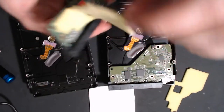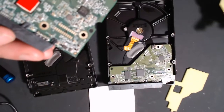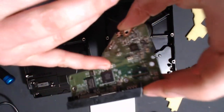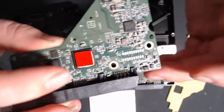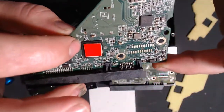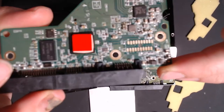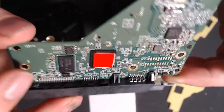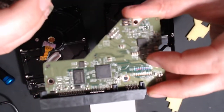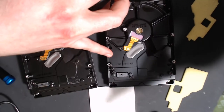This definitely has solder work on it — this is the one I fixed. I know it has solder work because it's sticky. This is a BGA chip — the connections are all underneath — and I definitely soldered that. But guess what — mine actually held up, because this drive got detected in my computer. I used CrystalDiskInfo and it said it was a good disk. This other one is getting freaking hot, it's not connecting, there's a problem with this board — which is actually good, because boards are easy to fix. Taking the drive itself apart is actually a pain.